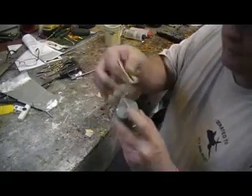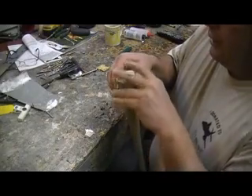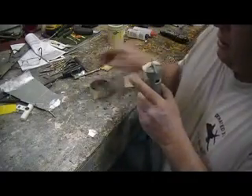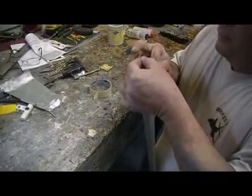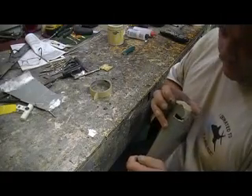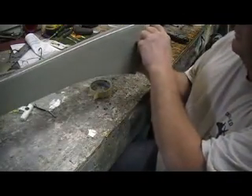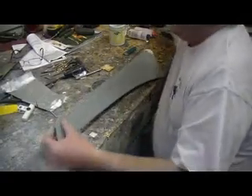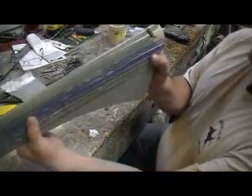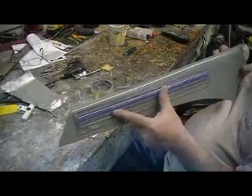We're going to tape this hinge right here on this hinge line, and put that pin — the pin in the hinge — even with the pin, and put it straight down. Now if you don't get all these pins lined up, it just won't work correctly. This is the biggie right here — all these pins and pin lines have to be lined up. Even though it's going to be a crooked line because it gets thinner, it's going to be really deep out here and not so deep on that end.